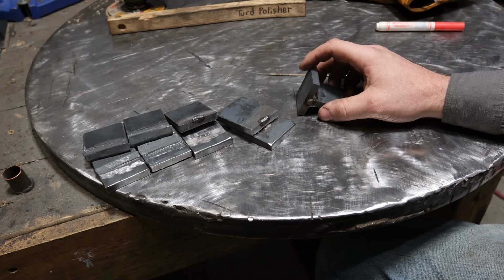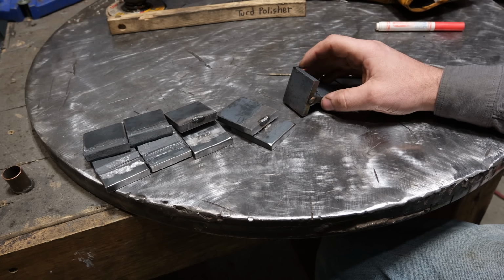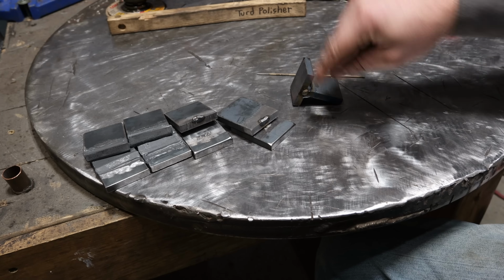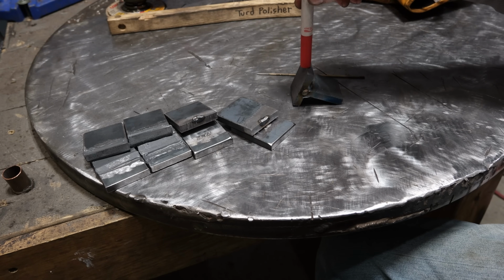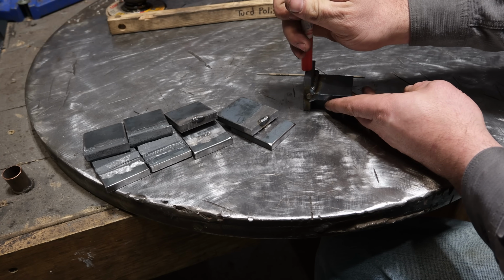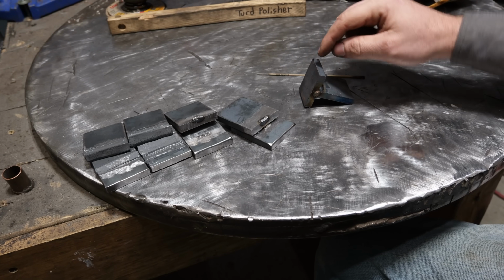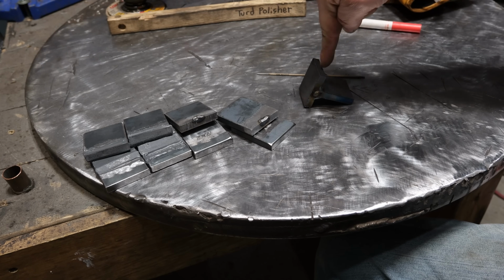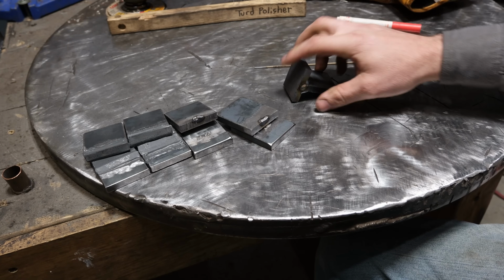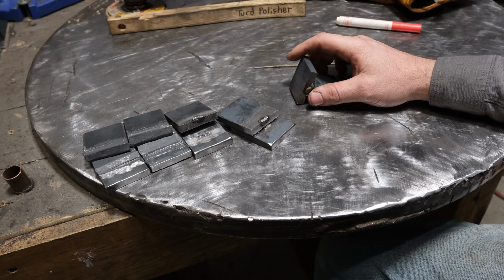The main thing I want to talk about is that doing a bend test like this is kind of, how do I put it? Not disingenuous, but the way it loads a weld is, well, if you can see here, as I push down here, there's a lot of force simply going into pressing that into the plate, like on a shop press. So initially, a lot of the force that you're going to see reading is simply the force of pushing it straight through the plate. Only when this upright plate bends, where this weld starts actually getting loaded on the toe of it, does the weld actually see a lot of force.